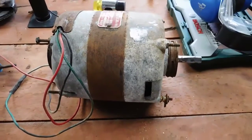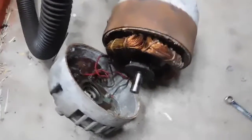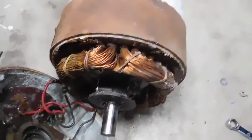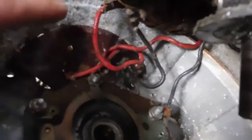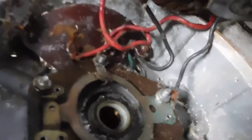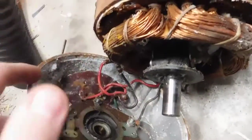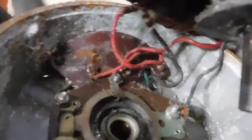I'm really not looking forward to this, to be honest. Well, I've got the rear end bell off, and I think I may be able to save this motor. It's actually not as bad inside as I was thinking it would be. There's a lot of oxidation and rust on that side of the housing, possibly from the orientation it was sitting at when it's been outside. But it's all surface stuff, and I may be able to grind all that out and clean it. The good thing is that the back bearing is fine.